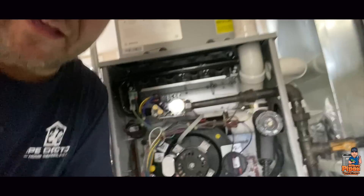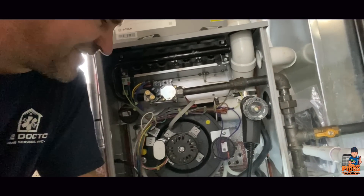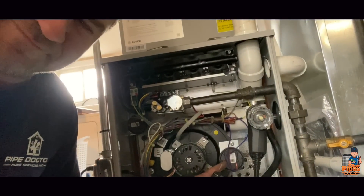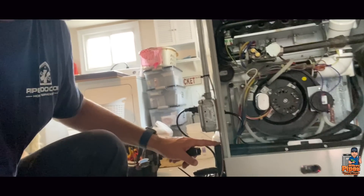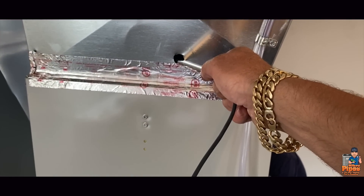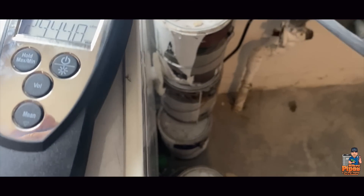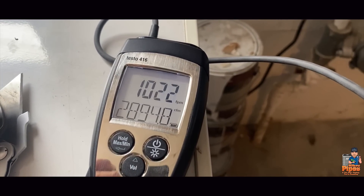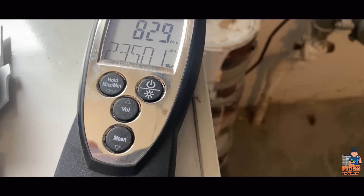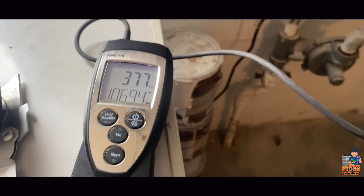While watching that condensate box bounce around, the furnace went off — E5 error. The pressure switch sensed that the condensate trap wasn't full of water yet, which caused the bouncing. Use your noggin! We're at almost 3,000 cubic feet per minute — that's pretty fast, actually off the charts. We need to find the right sweet spot.